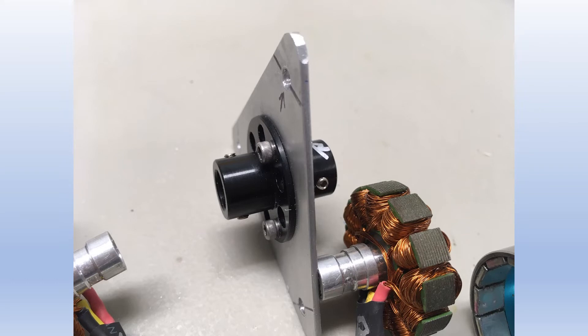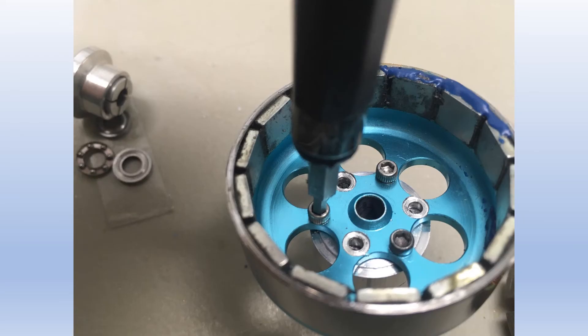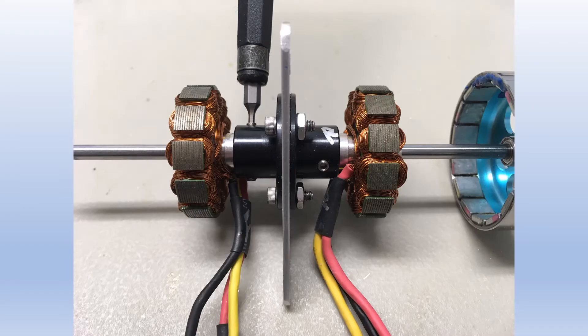This shows a larger and more useful motor mount sandwiched between the two original motor mount bases. I removed the bearing from the back side of the front stator because it isn't necessary anymore. Here the prop adapter is being secured to the forward rotor, and here's the front rotor and prop adapter ready to go. The stators are fed back into their original motor mounts and secured, and the rear rotor with the long shaft is inserted through both. And here we are with the finished motor.